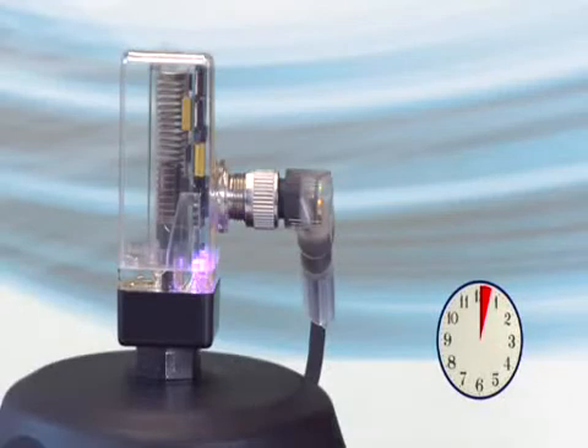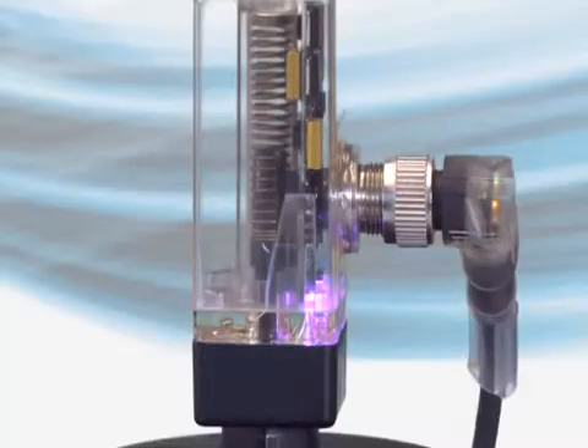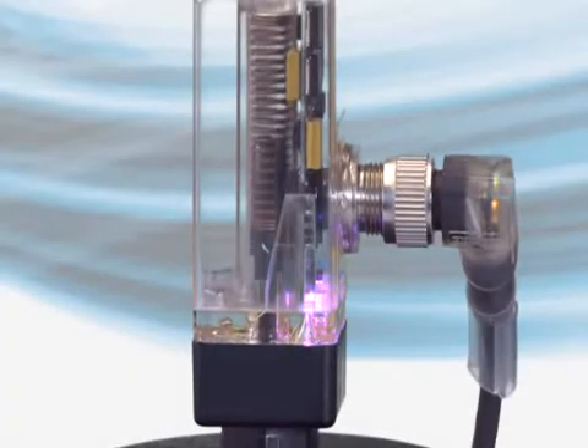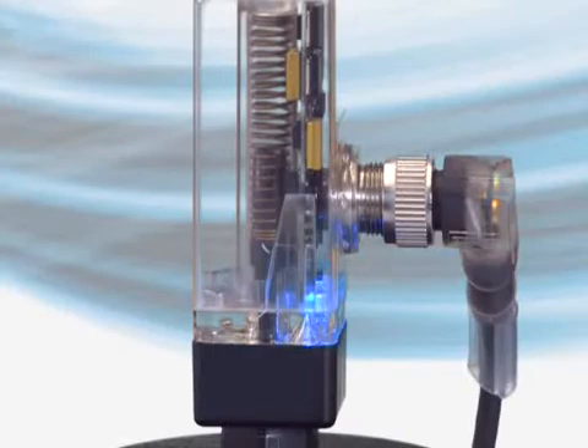After the third illumination, wait until the LEDs shine permanently violet. Open the valve and hold this position until the LEDs shine permanently violet. Close the valve to finish the programming. The end of the programming is indicated by a change in colors. The electrical limit switch shines blue and is now ready for use.